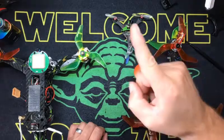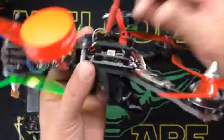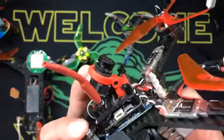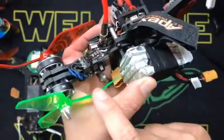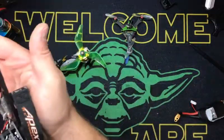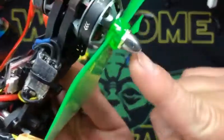The biggest reason people don't like Y4s is you need landing gear. Think about it — if you land in grass, you're probably not taking back off unless you really floor it, because this thing's going to be embedded in the grass. That bottom motor sits right on the ground. That is precisely why I use these motors — they have these old school cone nuts on them which suck, but for this they're great because that acts like a spinner on the ground, and it's only a split second — you arm it, poof, take off, you're done.